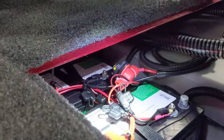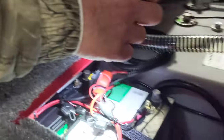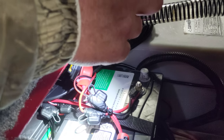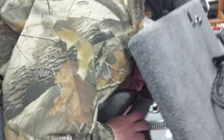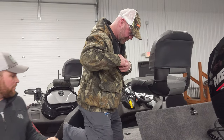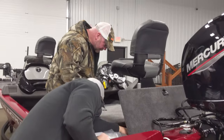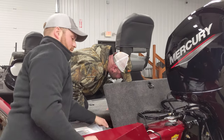You have two trolling batteries and one crank battery — they're Group 27s at 750 crank amps each. This is a 30-gallon fuel tank. There's also a red kill switch up front — when you flip it, it kills your power up here, so you can't honk the horn or turn anything on. That way you can't leave your livewell lights or your graph on to kill your batteries.